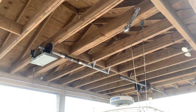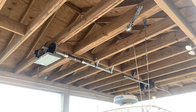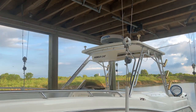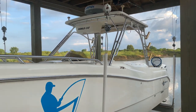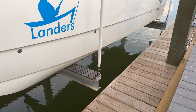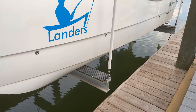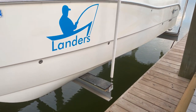For a quick overview of the entire system, we've got two motors that lift from four different points, so each motor lifts two points. Those two lifting points go down the rope here to the pulley, which turns into one rope. We've got a weight there, and then you've got your PVC pipe, which acts as a roller, down to the beam itself. Another thimble rope clamps there. Aluminum I-beam with a 2x10 bolted to the top of it, and then rubber mat on top of that that the boat actually sits on.